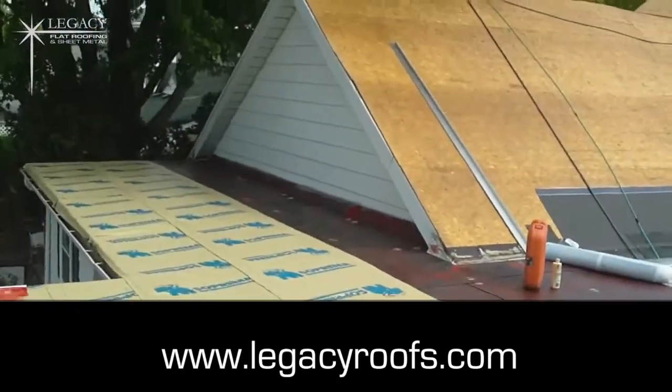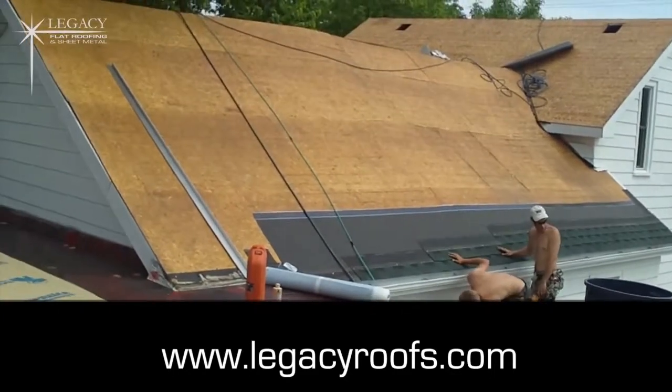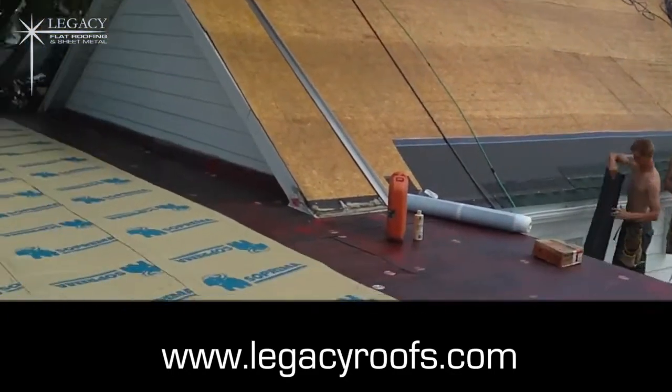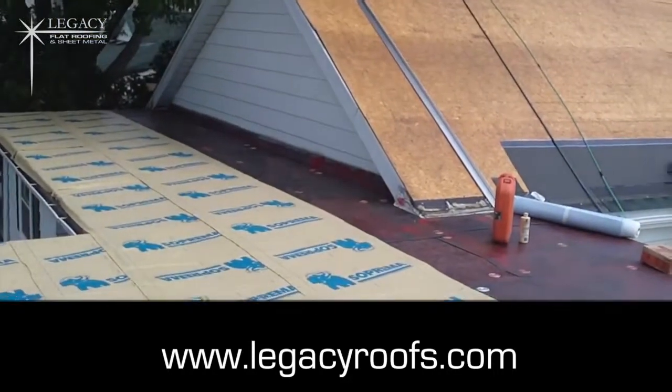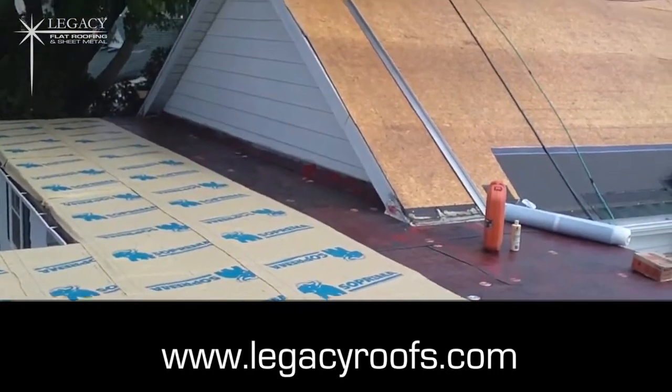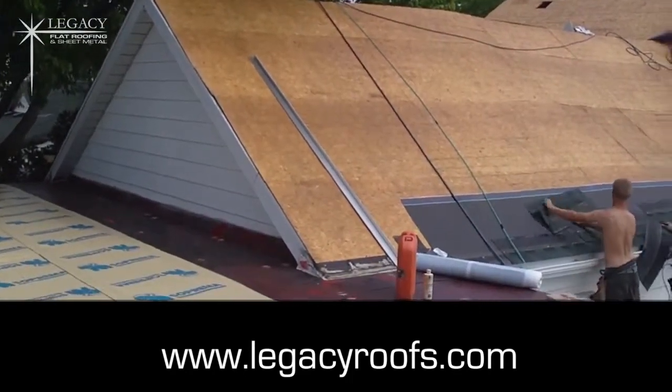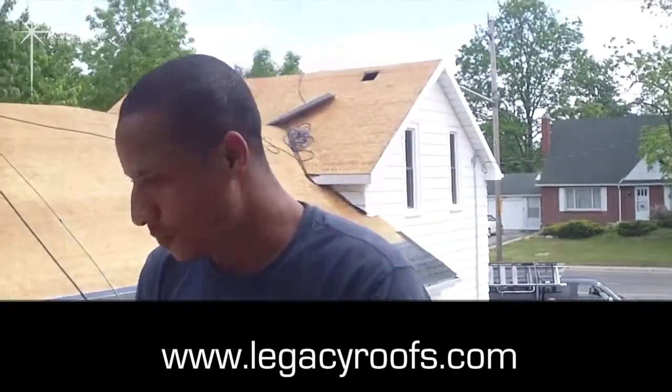You can see the shingle roof. They've put the ice and water shield at the bottom. We've started with the shingles along the edge. We've cleaned it all up. We got some drip flashing along the eaves there, so that's where we're at. I'll bring you back later. The job's going really well. We're making some good time. We got some beautiful weather. Rain's held out, so I'll bring you back later.